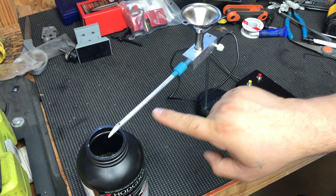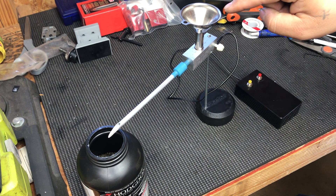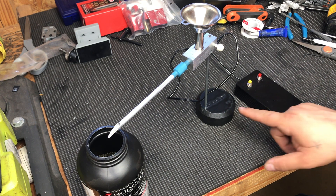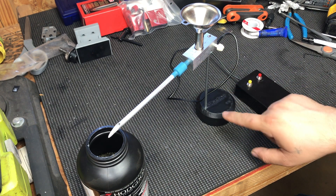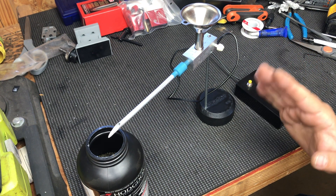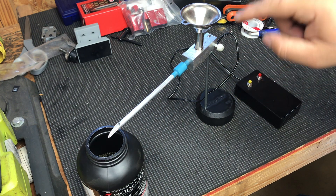This is a quarter-inch thin wall aluminum tube I got off eBay for five bucks, used for hobbies and crafts. This is a perfume funnel off Amazon, stainless steel, about five dollars and change. It's machined to the backside of this Master Lock — a truck lock that serves as the base, it's heavy enough. And just a 3/16-inch rod JB welded into it, slightly bent to give it an angle. This is an aluminum square bar machined down to about three-quarters of an inch on all sides, with a couple of holes drilled for the funnel to meet up with the drop tube.